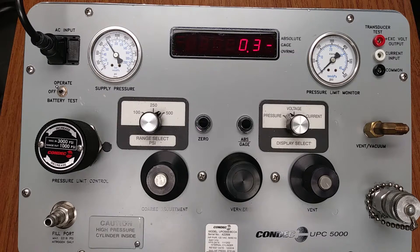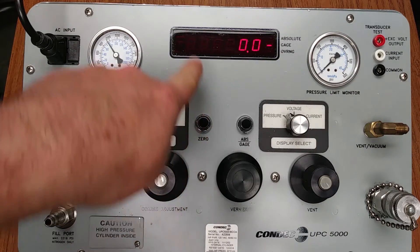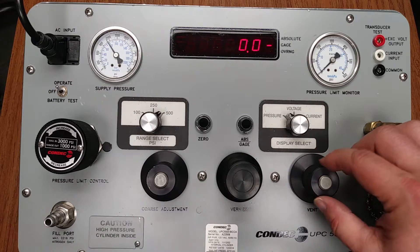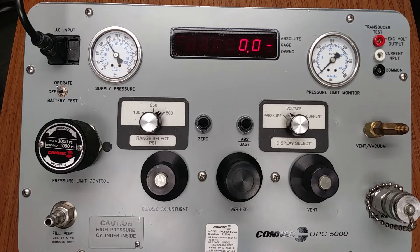The system and 400 PSI gauge only device under test preparation is completed — we are ready to begin the calibration. Push the zero switch button to zero the system — the display is zero. Close the vent valve by using thumb and forefinger to gently rotate the knob clockwise until closed. Rotate the pressure limit control clockwise while monitoring the analog gauge to reach approximately 450 PSI, which will limit the pressure downstream to the device under test.